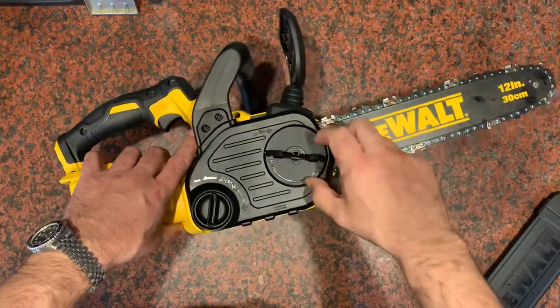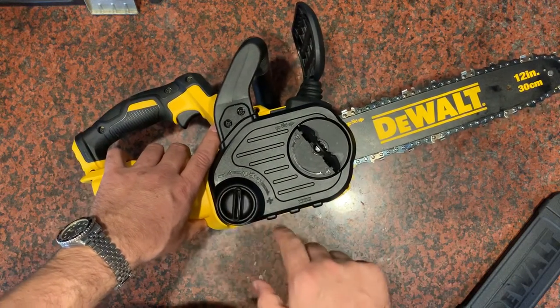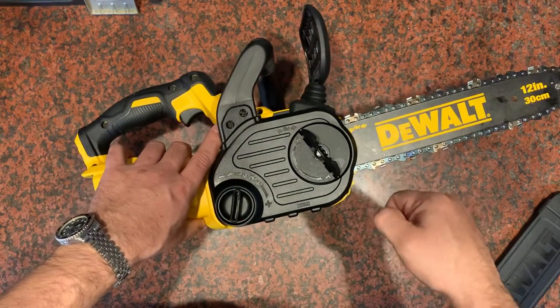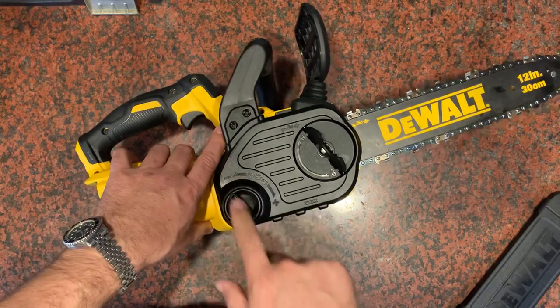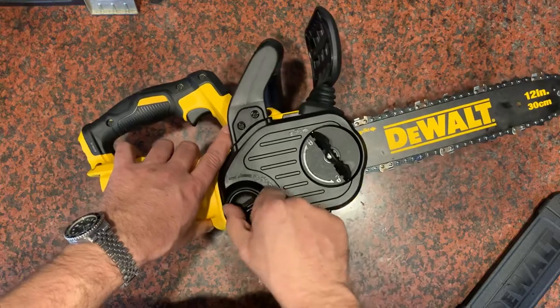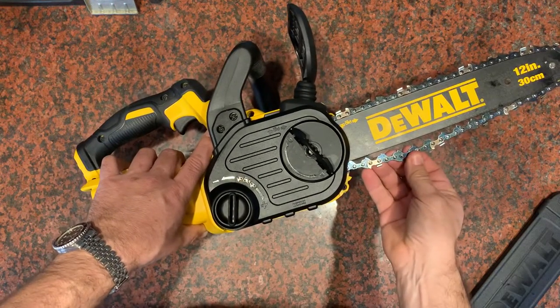So what you're going to want to do first is reduce that friction or loosen those bolts. Then you've got a control as well — sometimes it's located at the front here, it's just going to be some type of screw. In this case it's got a handle. As I screw it clockwise towards the plus side it's going to pull the chain in tighter, and as I go counterclockwise towards the negative side I get more looseness on the chain.